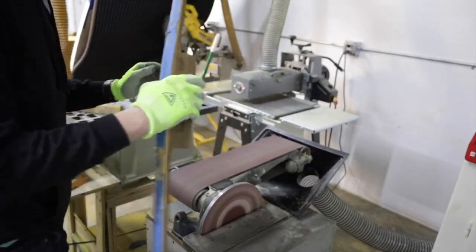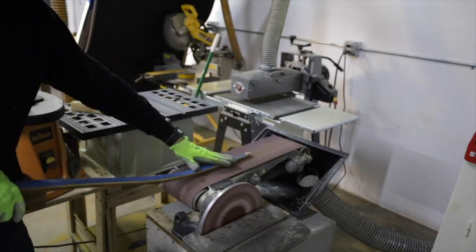Generally the weaker the material, the larger or thicker the wood needs to be. But it also depends on your width. But most bows are 3/8 of an inch to 5/8 of an inch thick if you're between a 30 and a 60 pound bow. So you can just keep that in mind as a reference depending upon the bow you're making. All right, now let's hit this up on the belt sander and hog off some material so that we can start bending it.